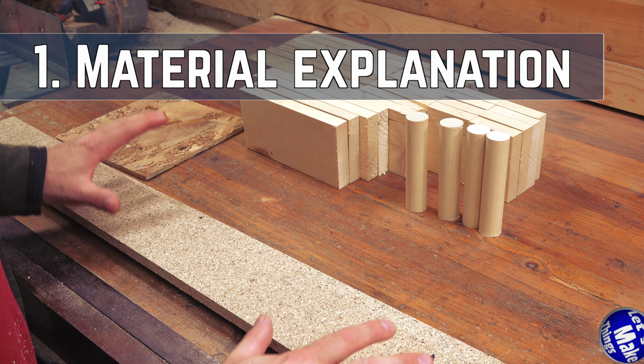On each one of these blocks, we want to drill in 1/2 of a 3/4 inch piece, which is 3/8. We'll make sure that lines up. And then I'm going to come in here with an awl and mark 1 of these. I've got a trick that I'm going to show you that I've made a bite-sized video out of. It's going to be in the corner right up here right now if you want to click on it. But let's go to the drill press.